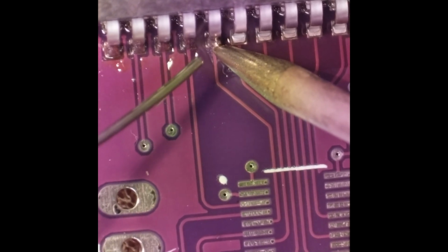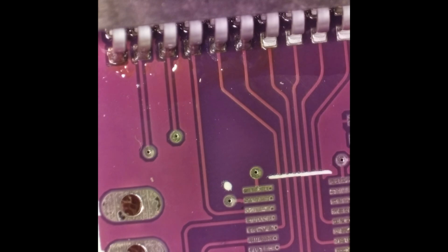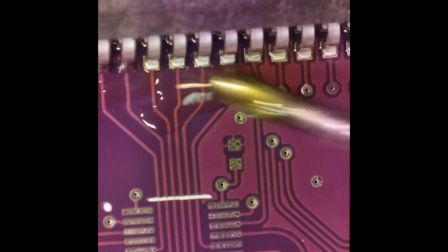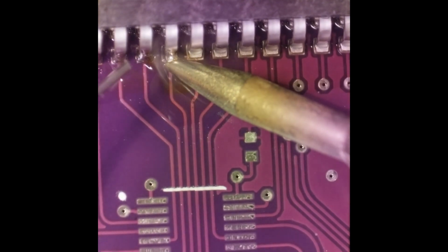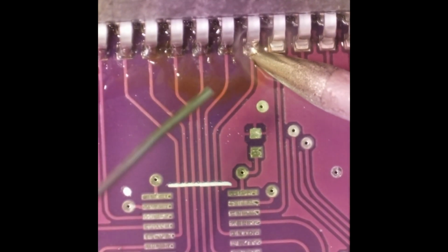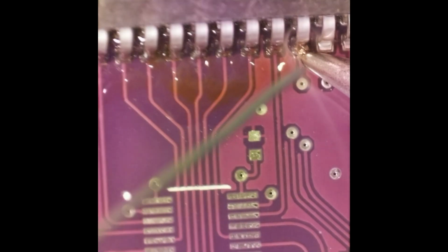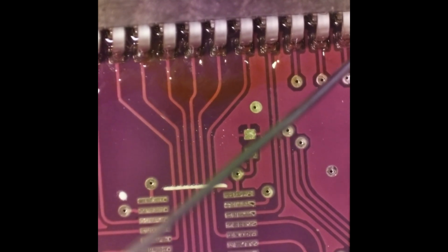The main thing is to get that solder flowed down onto the pads so that it connects that pin down onto the pad. And just keep going one by one. Some people drag their soldering iron across the pin so they can do it faster. That is just not the proper way, and you can cause solder shorts and excessive wear on your tip. This is a Metcal, so they got really strong tips and very durable, but they're not cheap. And you want them to last as long as possible, and the Metcal tip will last. If you take care of it, that Metcal tip will last forever. But you start prying on leads and dragging it and scratching it and digging with it, it's not going to last for very long. All you have to do is just one at a time.